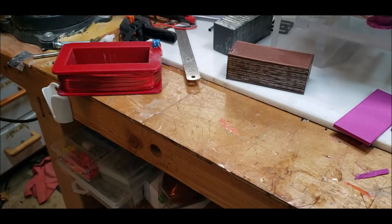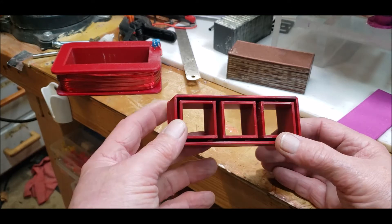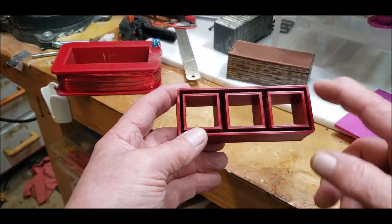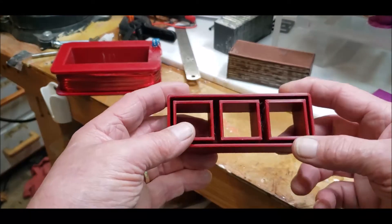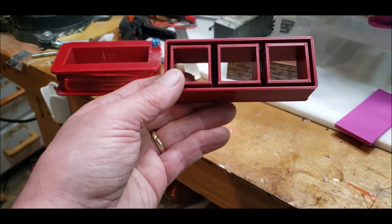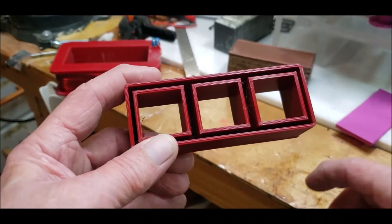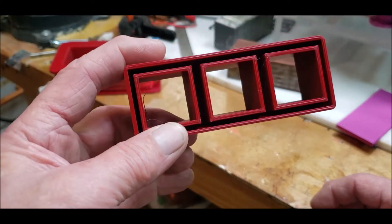What I came up with is this — just a prototype. I've got a better one printing out where I'll have more space in the air portion of the air-iron core. I'm going to fill it with low carbon shot or BB's — that's what one commenter told me to try, and I really like that idea. With this design I'll have the benefit of an air core but also some iron, which should increase the voltage gain when I use it as a pickup coil.